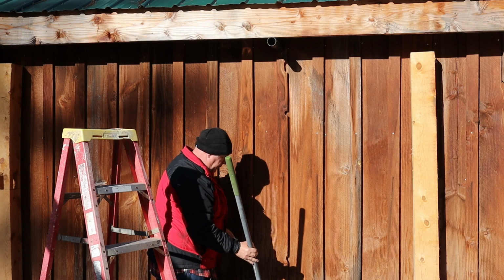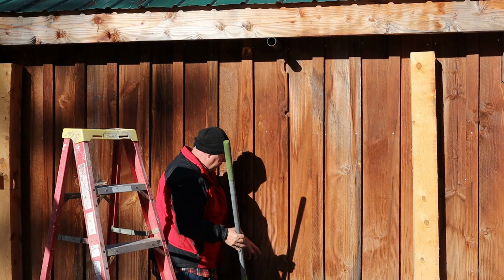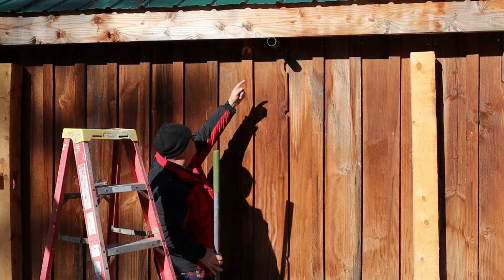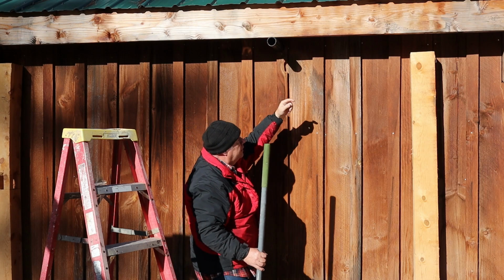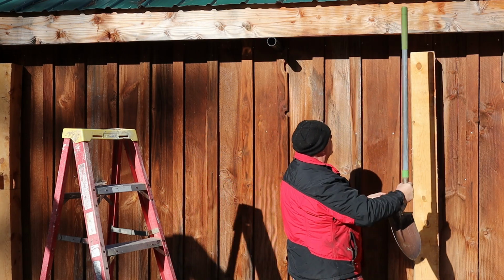I'll come out of that, come up with a P-trap into a sink, put a T in, put a vent, and vent up into that vent system I'm going to make, and then from that vent system I'm going to come up with another 90 over. This will be the pitch, the ridge cap on the top.